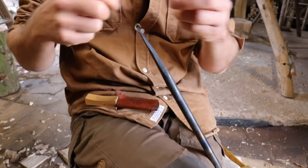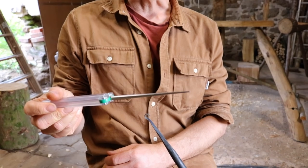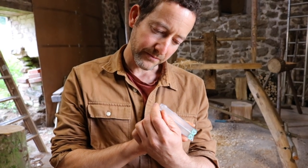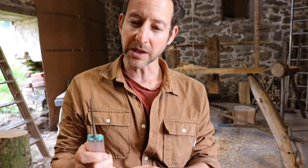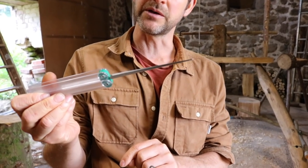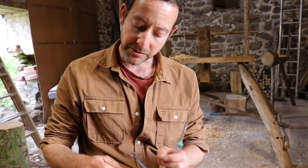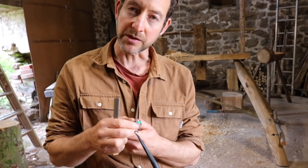I also have a flat DMT for the back of the tools, and on the inside I'm using a DMT diamond honing cone — essentially a cone-shaped diamond-impregnated tool. You can get these in different grits; this one is either fine or extra fine. Because some of my hook tools have quite tight, small hooks, this fine cone is really good for the job. Before using cones I was just rolling up a tiny bit of wet and dry paper and drawing it away from the edge inside the hook.